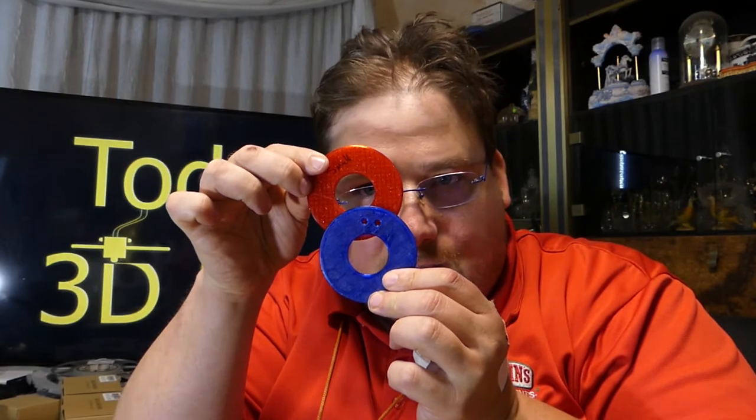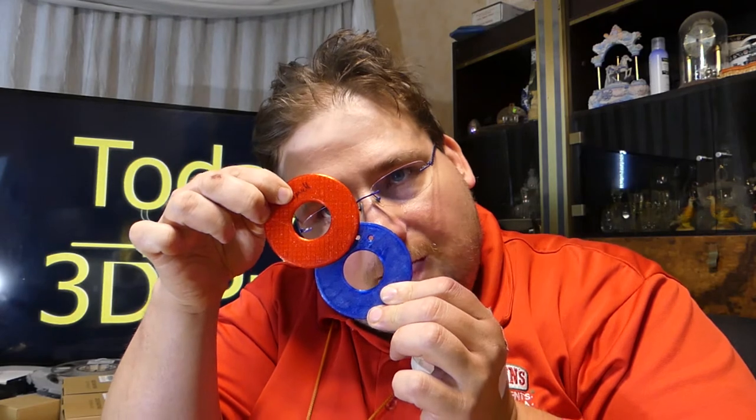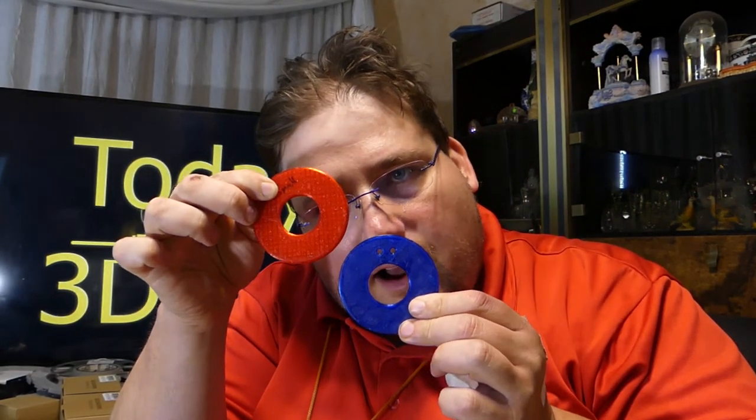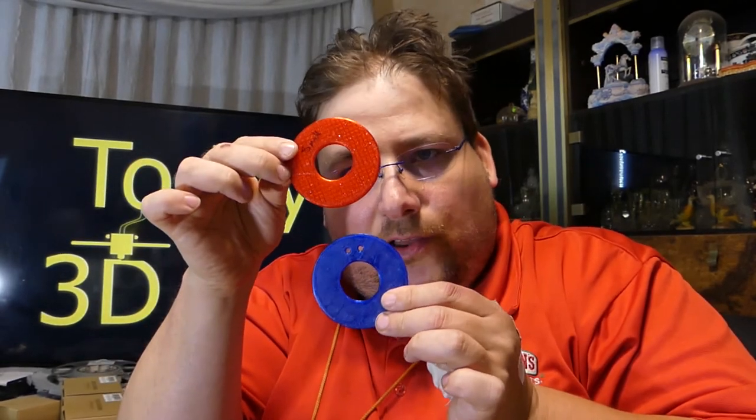which you don't want. Okay, so the solution for him was to lower his layer height so that when it moved over, the second layer was still touching the first layer. Because of his higher layer height, he had a gap, which is why the part looked like it was splitting apart, because you were literally printing in air. There was nothing there to attach to, and so the part started splitting. Okay? As soon as he lowered his layer height to 0.2 and increased his extrusion multiplier as a backup to thicken the wall, so he was getting a little bit more than a 0.4 millimeter extrusion. We were telling it to put a little more plastic there. So I told him to do 125%.